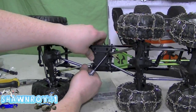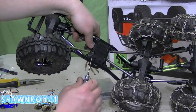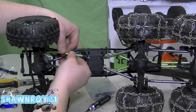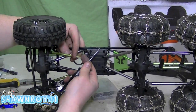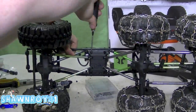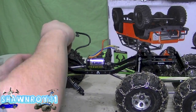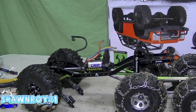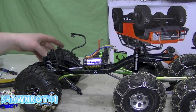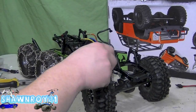All right, screw on both sides. Sometimes it's hard to try to get things lined up when you have the weight of the rig on that. This one was probably one of the harder ones — kept twisting on me. All right, finally got that. Get the shocks installed here to be able to see the stance. Shock spacer, right into the shock hoops. Same on the opposite side.